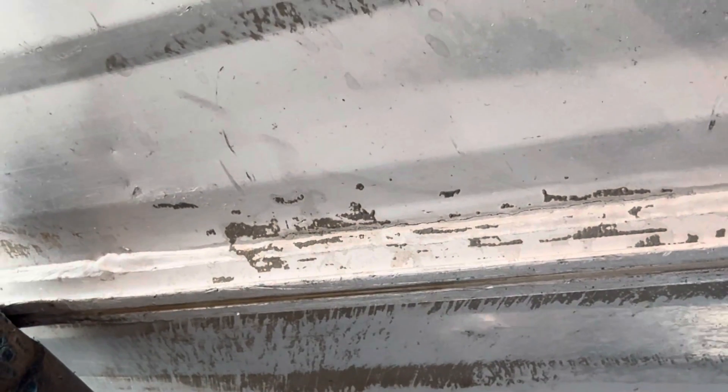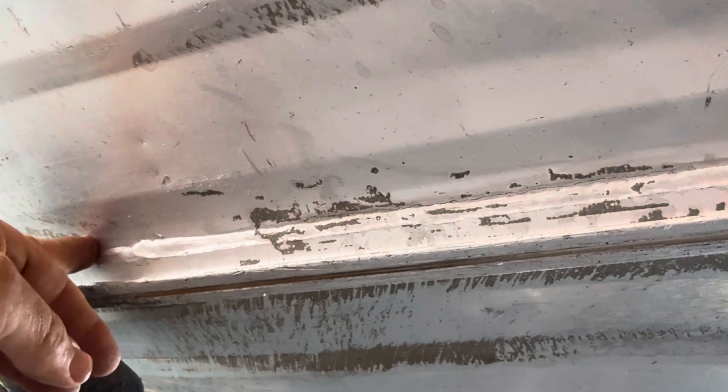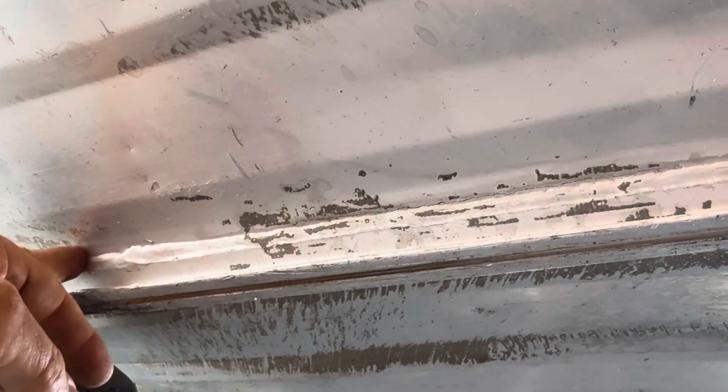The customer asked me: do you drill a hole in the end of it so that the crack doesn't run any further? I told him no, because of the techniques for doing this sort of thing. All I'm going to do is wire buff this whole area, and then where the crack looks like it finishes — I'm just going to weld past it. I'll weld 30 to 40 mil past it with a nice TIG weld right across the whole lot.